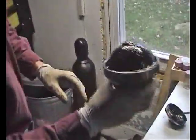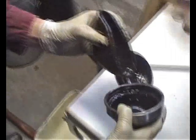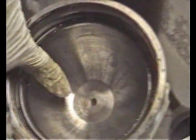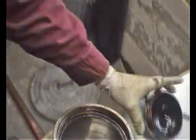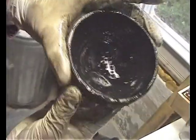So we're going to clean that out and throw that away. Look at that. So we won't have as dirty a hydraulic filter when we're all done, that's for sure. We just did a quick wipe, and you can see down there — that's the port where the hydraulic fluid comes in. It's completely plugged with old diaphragm. So we've got a lot more cleaning to do. We're going to have to clean the ports here and make sure there's no leftover diaphragm in there. The top should be pretty easy, but we need to make sure that the fill hole for the gas is clear. We'll do that and clean up the threads — they're not bad on this sphere, actually, but there's a little bit of rust that we'll clean out.